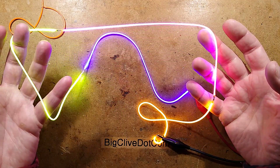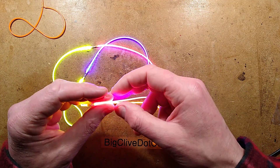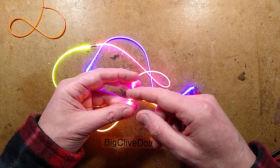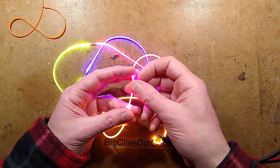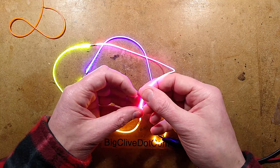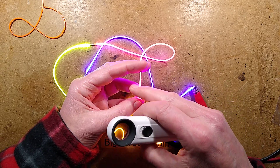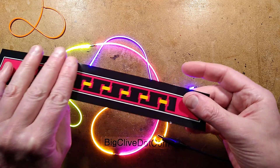Flexible LED filaments. I got some and stripped one apart to take a look, but they're quite hard to strip. I was hoping to peel the silicone off to reveal the circuit board, but any attempt to scrape gently with a knife just cut the circuit board. I put pieces in various solvents hoping to dissolve the silicone — no luck. So instead I illuminated one at controlled intensity, stuck a magnifying glass over it, and created a graphical representation, which I'll come to in a moment.